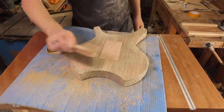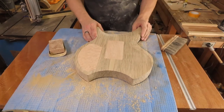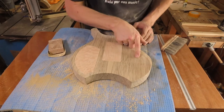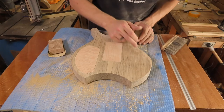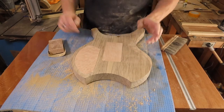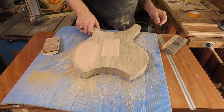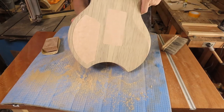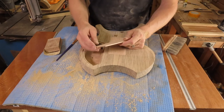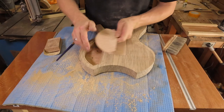This is starting to look absolutely great — got a really nice fit on this cover plate, really excited about this one. There's just a little bit of a weird spot in the grain which I'm going to try and sand out some more, but with the cover plates in place I can just keep sanding until I'm satisfied with the result. I always aim for a three to three-and-a-half millimeter thick cover plate and this is still near four millimeters, so I can sand it back just a little — plenty of thickness left.